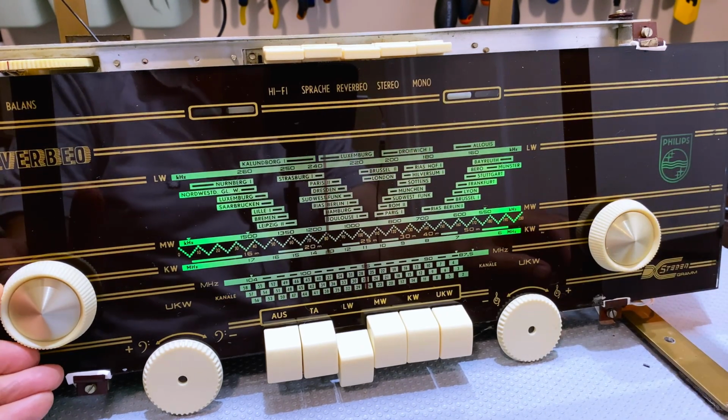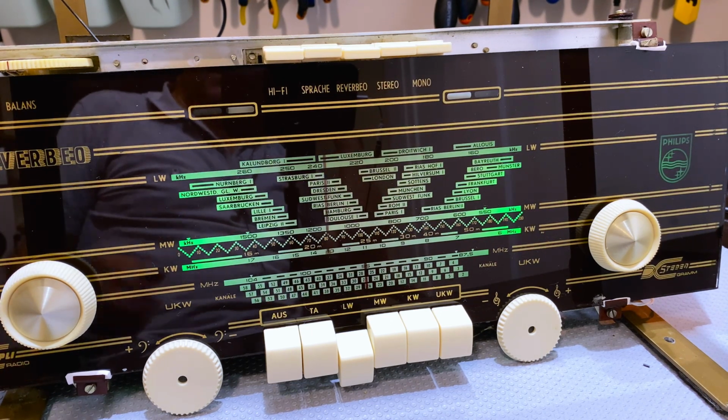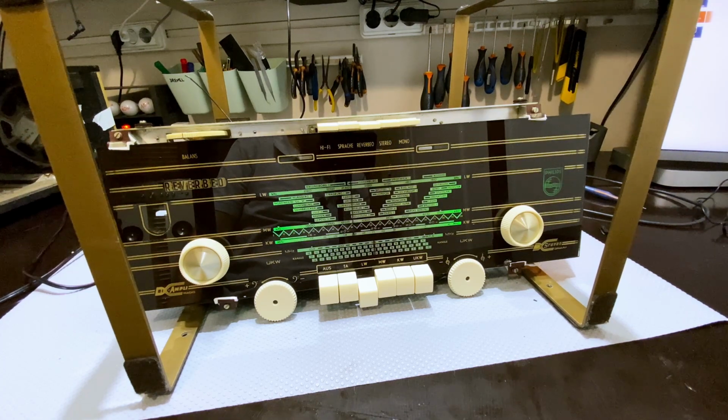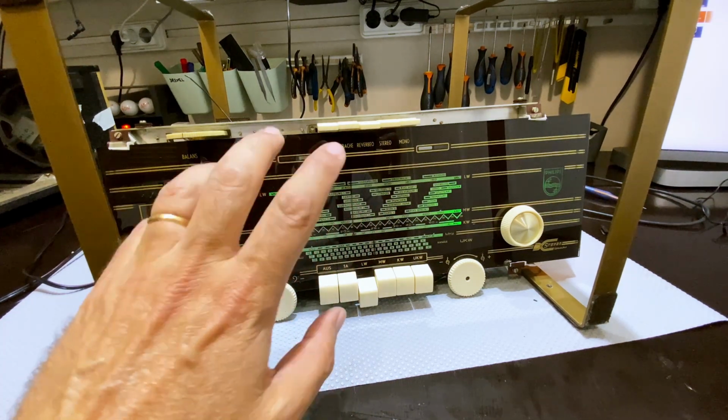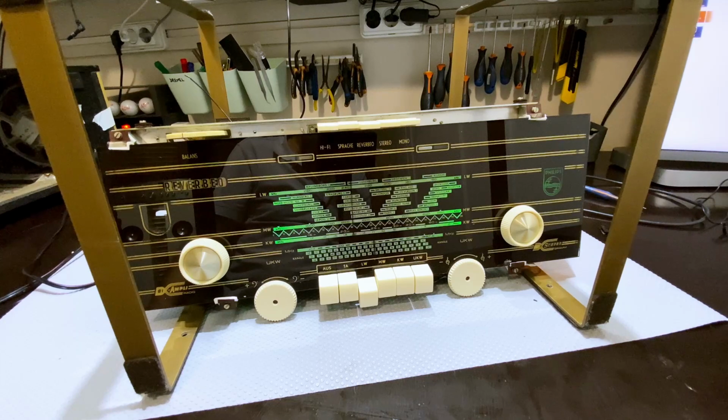So this may well need a bit of RF alignment, and I'm not sure how to do that right now. I have to check the instructions again. And once again, I think the instructions will tell me that the way to do this RF alignment will be exactly the same as doing the RF alignment for the 23A that I did. Probably the same as the 43A B7X. So although this doesn't have actual alignment instructions for this model, I can get that information and sort of extrapolate looking at the schematic to this model. So I'm going to think of doing that, and then I've obviously got to look at the FM. I'm not even sure that it's working yet, but suspense is great.